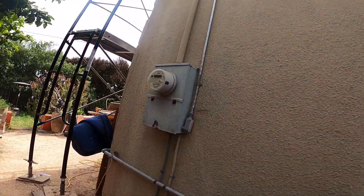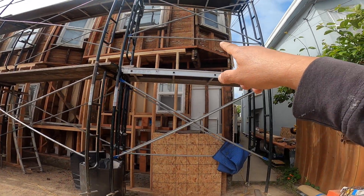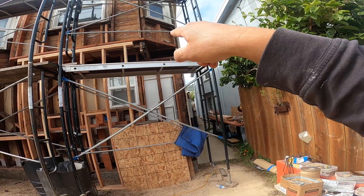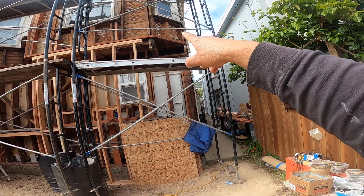What we did out here — there's a bunch of dry rot on the cantilever. Those are the two wood pieces I mentioned to you in the video I showed you inside. Those are basically buried from the edge of the double top plate — it's 4 feet — and the stick-out is 24 inches.